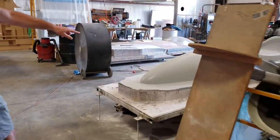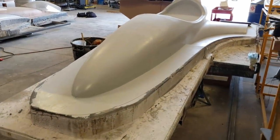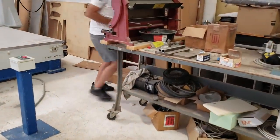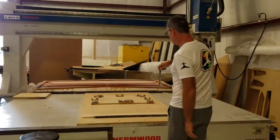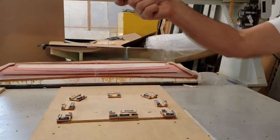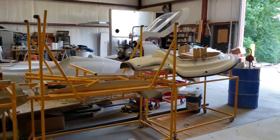As you can see over here, this plug. That started as a large block of foam. And then a tool bit this big — talking huge — went in there and basically cut that big block of foam into the shape of the aircraft. Then we put a hard skin on it, release it, and then we make the molds from those things.